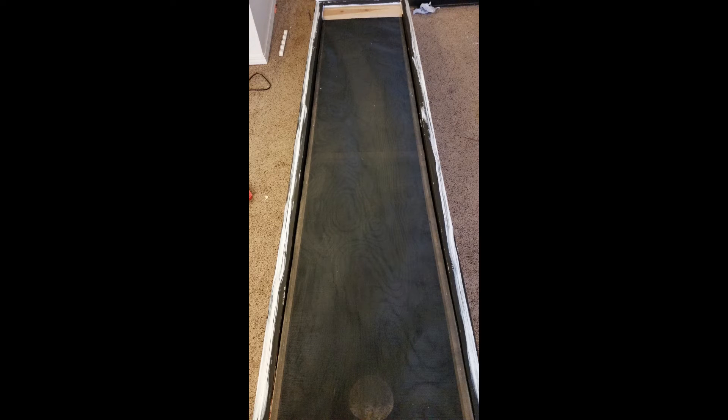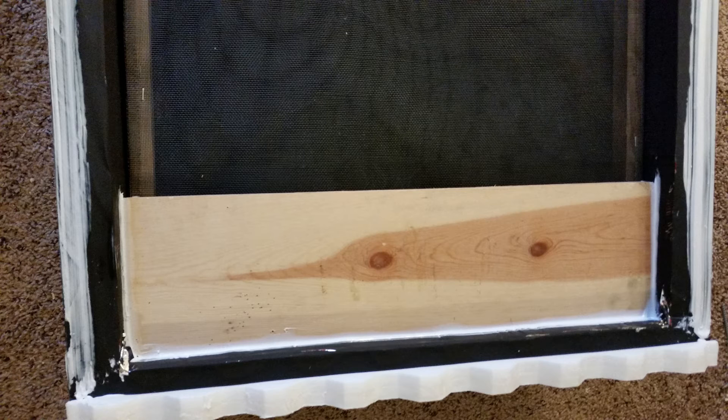I then installed the screen at an angle so that the inlet side is closer to the screen and the air will come through the screen and get heated as it travels up towards the exit. I cut a piece of wood and siliconed it to the foam about in the middle of the solar heater, which acts as a baffle to keep the air from going straight up underneath the screen without getting heated. If the air goes underneath the screen it'll at least hit this baffle and be forced upwards. On the inlet side I have this piece of wood siliconed in place sitting on top of the screen so that air coming into the solar heater doesn't blow in and hit the corrugated roofing material, decreasing efficiency. So the air will hit this and be deflected up.